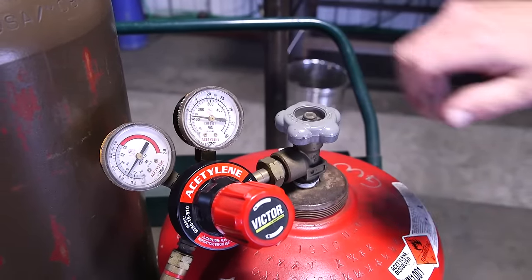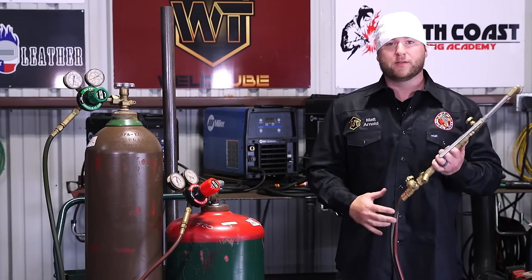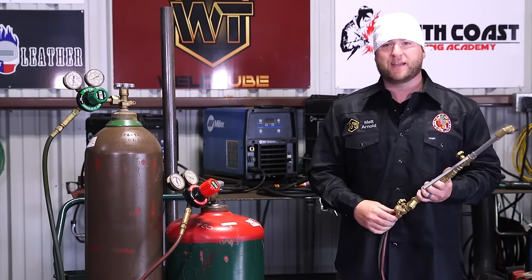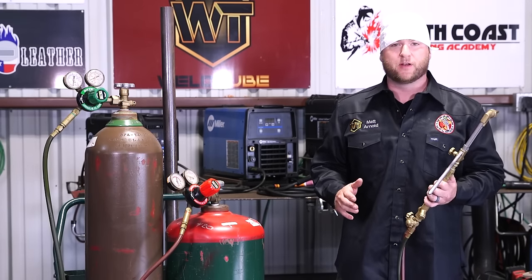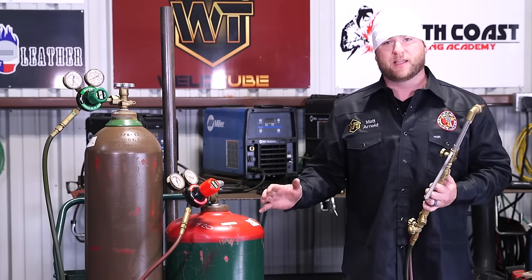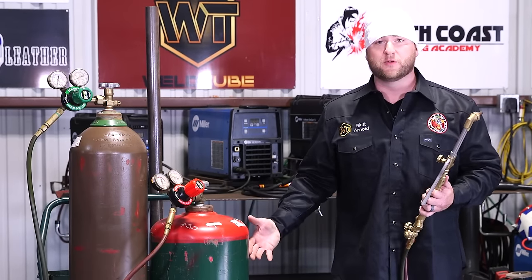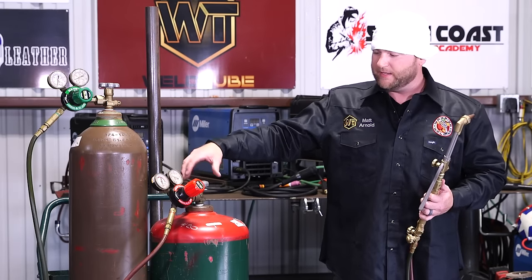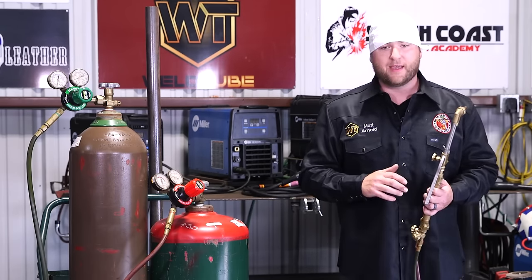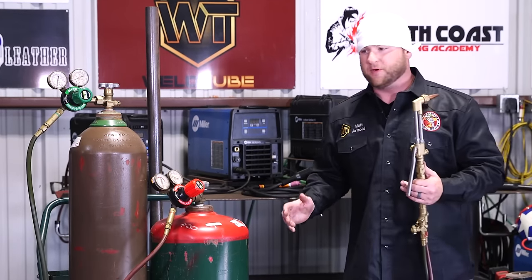And on your acetylene side, we only need about a half to three quarters of a turn. And why? Well, it's for good reason. If there's a safety issue, like I said, God forbid something would happen, but if a fire would break out and you need to shut these cylinders down super quick, this is the one you're gonna have to kill the fastest because this is our fuel cylinder. So by only having it open about a half turn, you can run over to it in 2 seconds, you're shut down and you're out of harm's way, okay?